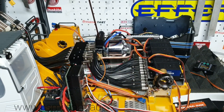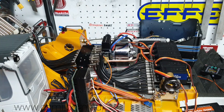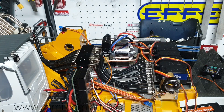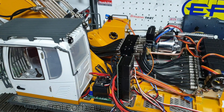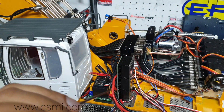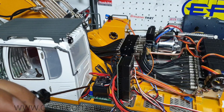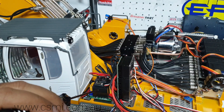On the other side, here is the pressure-regulating manifold. There is a screw up here with an O-ring. For those of you who have this machine and have a slight leak, you need to change the O-ring because the original one had a cross-section diameter of 1 mm, but it should be 1.2 or 1.5. If you bought that from us, contact us and we can send you that O-ring. There are also some switches up here - I highly recommend you don't touch them. There are three switches for the three-speed controllers and they must stay on - that's how they get their power. If you move the switch and power the radio, they may go into a setup mode that can cause all kinds of problems, so if you don't know what you're doing, don't touch them.